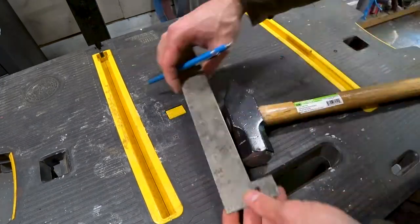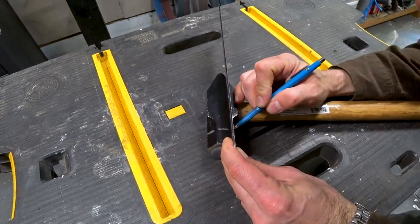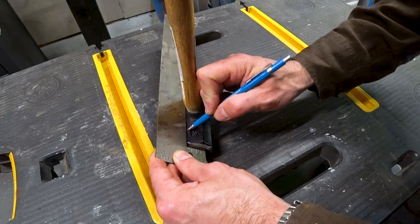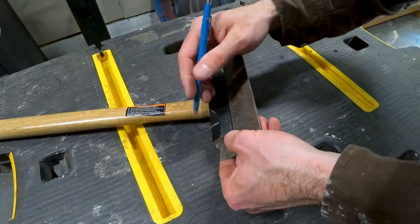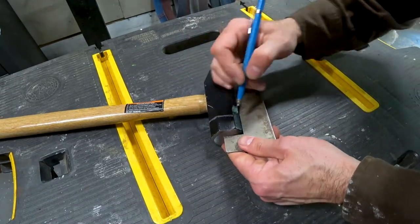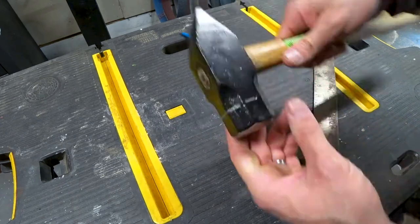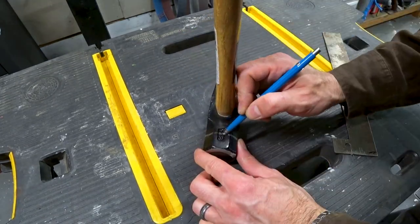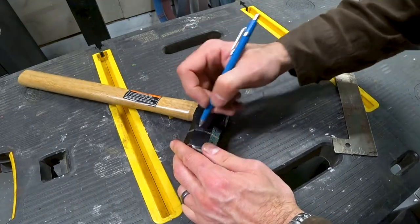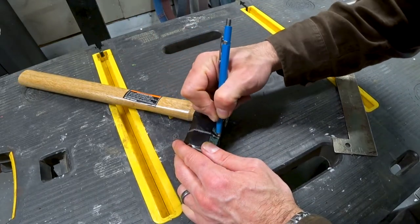What I'm doing here is marking out the portion of the hammer I want to remove. This is a three pound cross-peen and I'm most comfortable forging with a two and a quarter to two and a half pound hammer, so that excess material has got to go. I calculated how much I need to remove and I'm marking out how much to cut off — about half a pound of material.